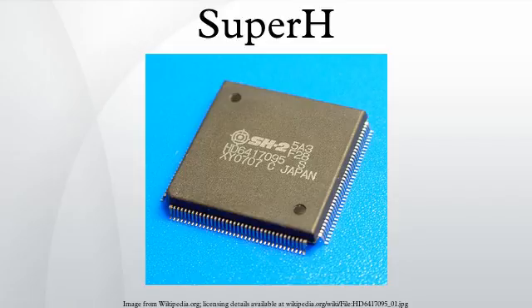The SH4 is a 32-bit RISC CPU developed for primary use in multimedia applications, such as Sega's Dreamcast and Naomi game systems. It includes a much more powerful floating-point unit and additional built-in functions, along with the standard 32-bit integer processing and 16-bit instruction size. SH4 features include: an FPU with four floating-point multipliers supporting 32-bit single precision and 64-bit double precision floats; a 128-bit floating-point bus allowing 3.2 GB/s transfer from the data cache; a 64-bit external data bus with 32-bit memory addressing allowing a maximum of 4 GB addressable memory at 800 MB/s; and built-in interrupt, DMA, and power management controllers.